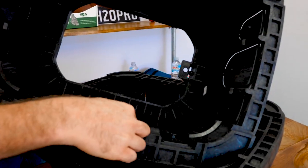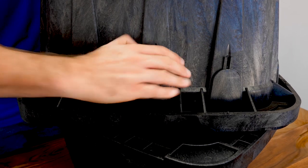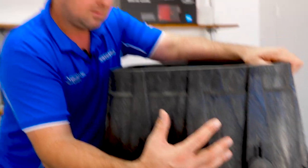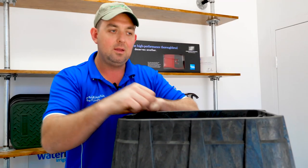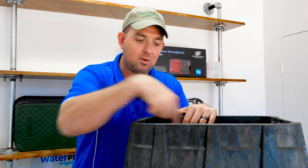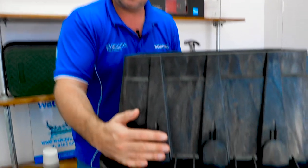There's a little shaft there that slides back down. You pull that off and then it slides back down, so you can get it quite low on top of the pipe that's gone through the hole. You have a small hole there, but then you just wrap some plastic around that and tape it up. The idea is that it stops dirt from coming into the valve box. Too many times you'll see valve boxes where they've cut everything off just to get it level with the finished grass level, but underneath nothing good's been done — grass, loam, and roots all come into the valve box because it hasn't been installed well.